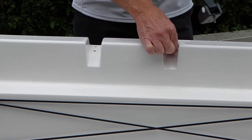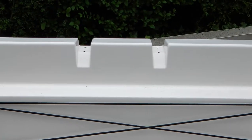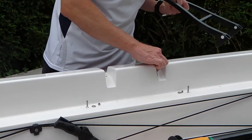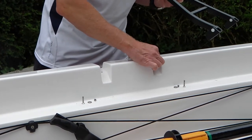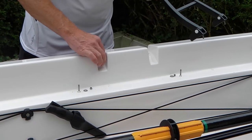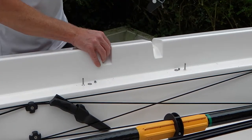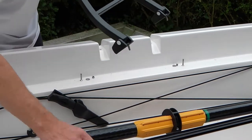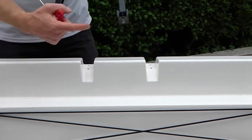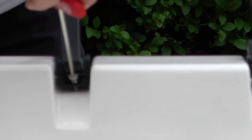It stops any mud, water, grime or dirt getting into the screw thread, so that when we are changing position of the riggers it's very easy to put screws in and out. I'm going to put them straight back into the forward hole where I've moved the rigger from, protecting the screw thread in there. Now I'll grab my T-bar and align these screws up with the inner holes, just gently starting the thread off — not too far, just so it locates.